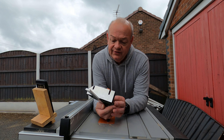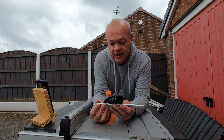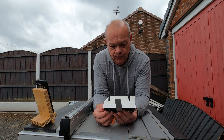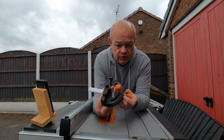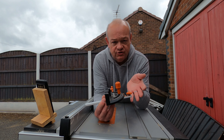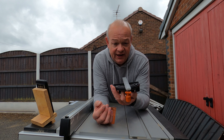In this week's video I'd like to create a more effective miter gauge for my Rage 5S table saw. A couple of the projects I've done recently I've gone to use the miter gauge and to be honest, although it's well made — solid cast aluminium — it's just not very good. There's a little bit of play in the runner, and the length of material isn't that big, making it difficult to use. So what I'm planning to do is make a miter saw sled or a table saw sled using this existing miter gauge.